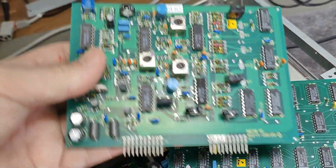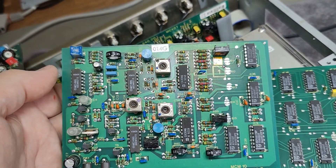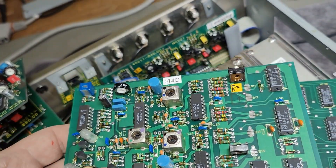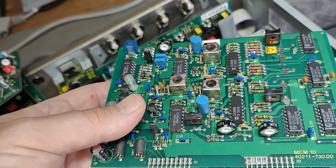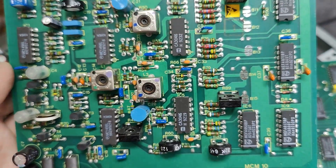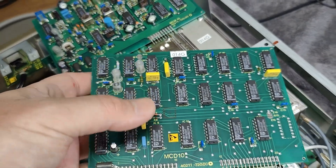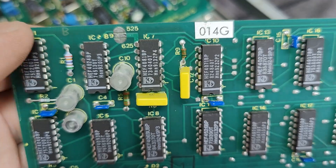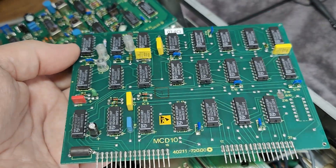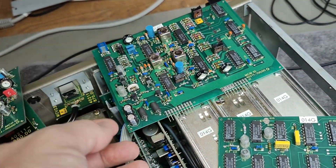What's next? This is MCM. We got some different filters, and we also got some higher speed stuff that is mixed. I don't know exactly what is going on here on that one, to be honest - a lot of solder options, that's definitely for the different PAL and NTSC modes. And the last one here is MCD - I think this is digital, doing some line counts. You can see here the different lines, but a lot of stuff is really done in ICs: tons of counters and multiplexers and switches and flip-flops and all that kind of stuff, and a lot of analog circuits.